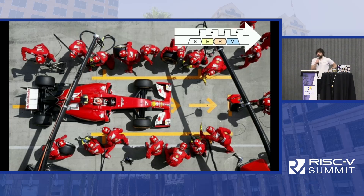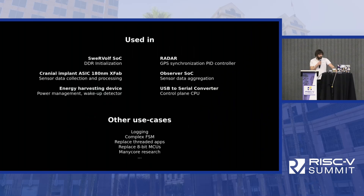In many chips, you have a lot of accelerators and the job of the CPU is really just bookkeeping, logging, or some other simple task. It doesn't have any fixed purpose but might need to jump in when accelerators don't work as expected. Current use cases include DDR memory initialization, logging, slow sensor data aggregation, and control planes.